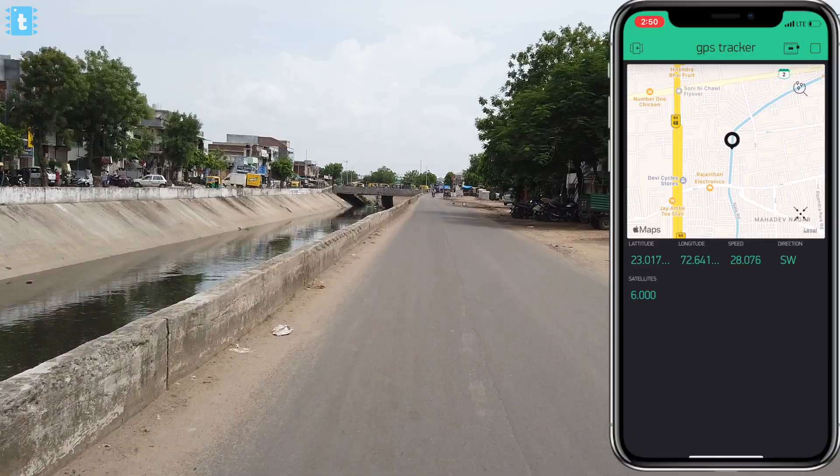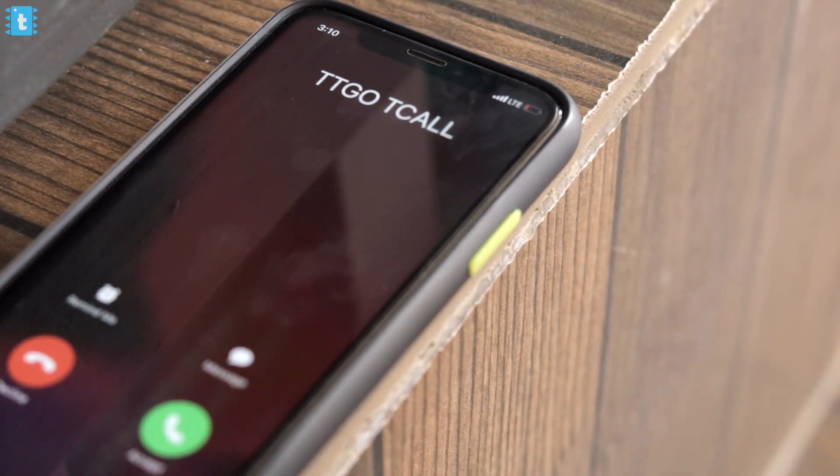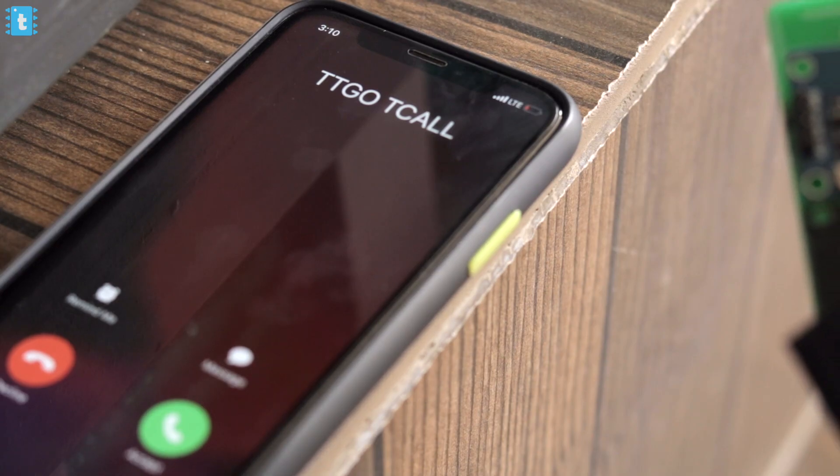The project is working completely fine. Now let's explore the emergency features. I've provided two: one to send an SMS and one to make a phone call. Imagine a scenario where you have this project and you're stuck in an emergency, but the person on the other side is not monitoring the Blynk app and is busy. You press the call button and it immediately makes a call to that registered number to notify them to check the Blynk application and track your location. Note that this call doesn't support voice data transfer as there is no speaker or mic built in.